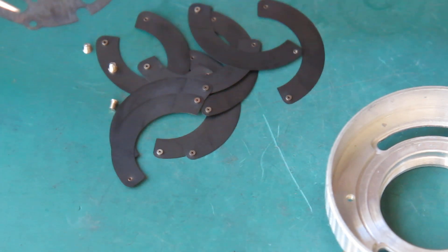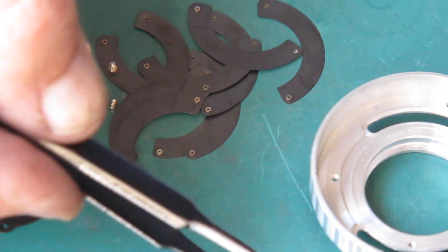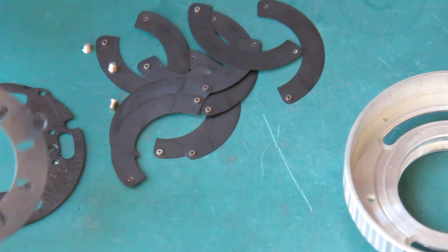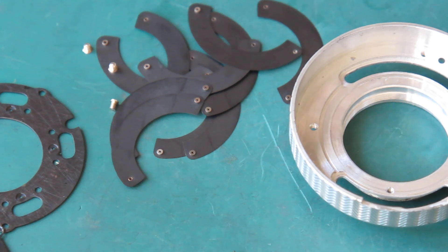Here's our diaphragm blades. They will hold together in a rosette even when clean if they're closed right up. You can see quite a bit of the oily marks on these blades where they've been sitting over the top of each other, and they'll all need to be cleaned. They should be completely free from oil. The retainer plate here looks quite good — there are a few marks and stains, nothing exciting. Likewise, this moving plate looks fine too. All of this stuff looks to be in good order — just needs to be cleaned.